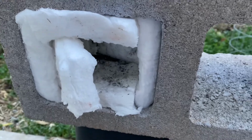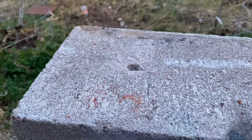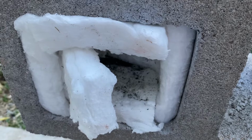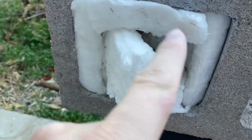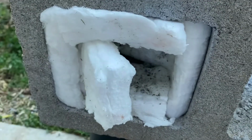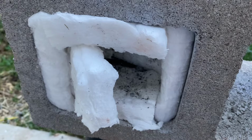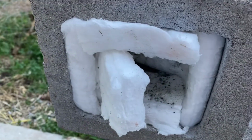So anyway, like I said, dirt cheap. You could probably get away with not even drilling that hole out. Just realize that there's going to be a lot of expanding gases shooting out of that chamber. So you also want to make sure that you have a mask on, because like I said, if you inhale any of this, you're going to have permanent damage to your lungs. You want to make sure that you have some type of filtration, some type of mask, an N95 mask to filter out those fibers, because they'll come off and you'll inhale them if you're not careful.